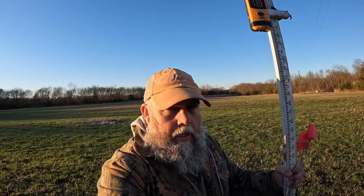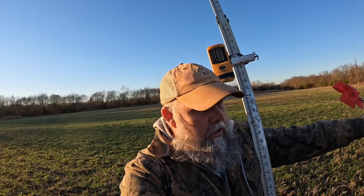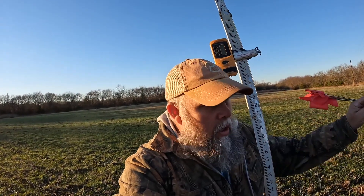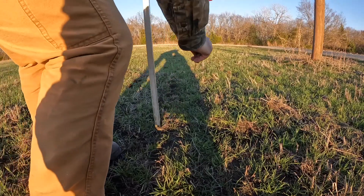From here, once I get a tone, I can walk back and forth and see the ground getting closer to my stick, which means it's going uphill. Going back the other way, it's also getting closer to the ground — going uphill on both sides. So there's an arc right through here where it goes uphill on both sides. For big construction projects they'll use more sophisticated devices to take exact elevation readings. But in this case I'm just going to eyeball it as I walk through and find my low spot, then stick a flag in the ground. I don't have to be at the exact lowest spot — I just need the general low area, because once I dig the ditch it'll be even lower and the water will drain precisely.